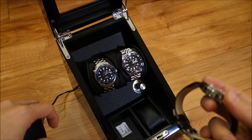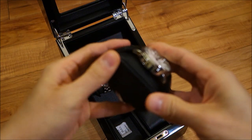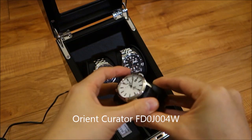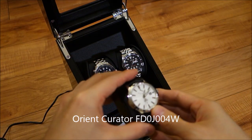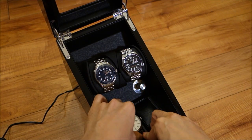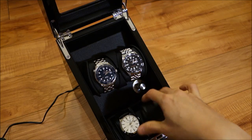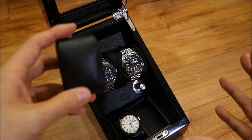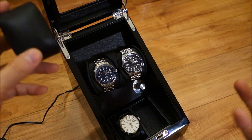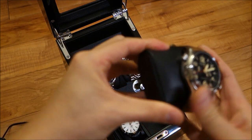There's also talk about whether watch winders can harm your watch — specifically whether you could overwind the mainspring and cause damage. In some vintage watches, yes, that could be a concern. But realistically, with this programming where it rotates for three minutes and rests for about ninety percent of the time, it's hard to imagine that causing damage. Modern automatic movements have protection mechanisms that prevent overwinding, so you're probably not going to harm your watch.